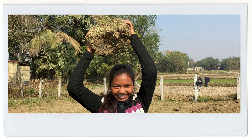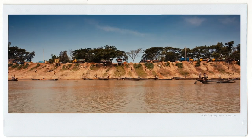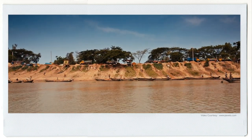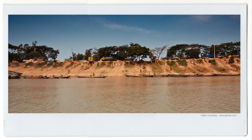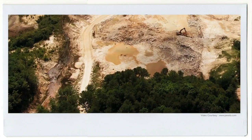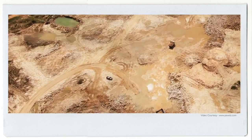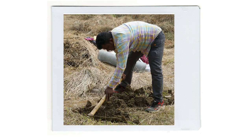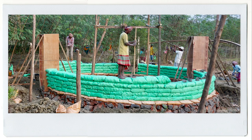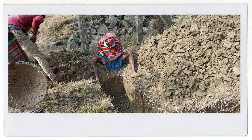The soil on Dularia land is composed of more than 90% clay, which means we would have had to bring in large quantities of sand to mix with it for any other type of natural building style. Sand is being mined extensively from river beds, which has a devastating effect on riverine ecosystems. So we minimized the use of sand and built using the earth bag method, which has the major advantage of being feasible with any soil type.